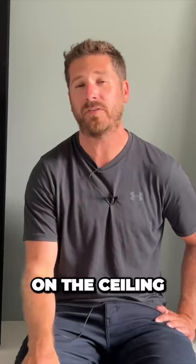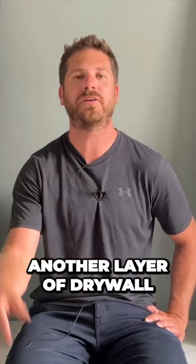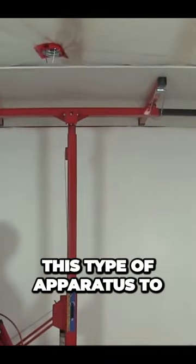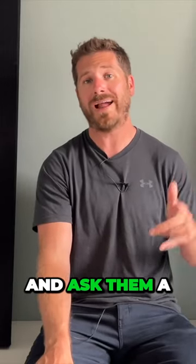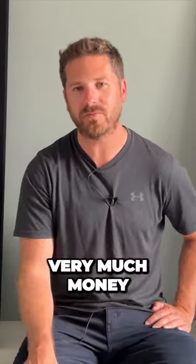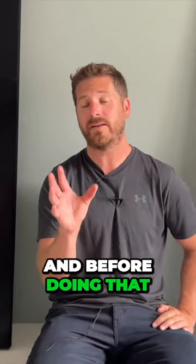It's time to add another layer of drywall on the ceiling. You might think it's not that easy, but it is. You can get — just look on your screen — this type of apparatus to basically add the drywall for you. Go to your local hardware store and ask for a tool to install drywall on the ceiling. They'll know exactly what you're talking about, and you can rent it for not very much money, then bring it home and add a layer of drywall onto the ceiling.